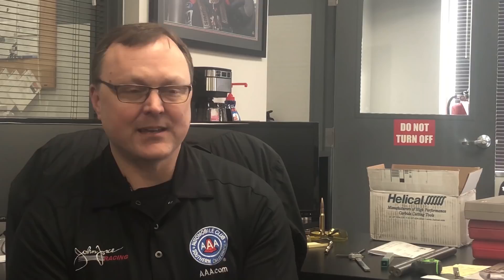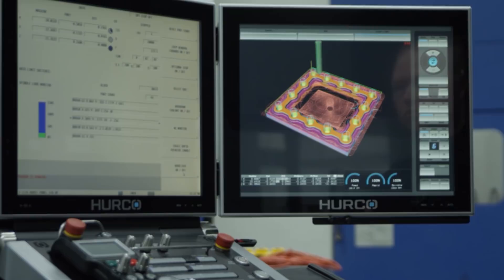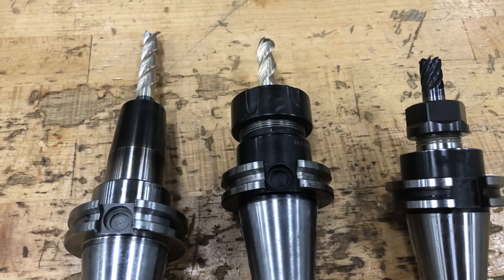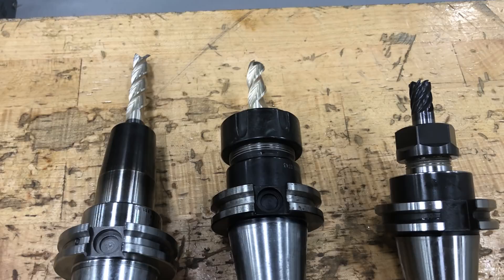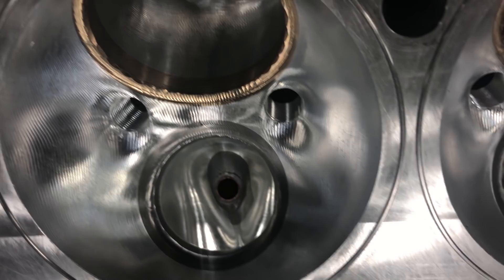The first time I used the Machining Advisor Pro, we were experimenting. I thought we were going as fast as we could with this end mill and we were still having some issues with wear. Dolan came in and explained that the Machining Advisor Pro system was pretty good. So I tried — I went through the system, calculated it out, fed it the materials, and the numbers it spit out I couldn't believe. I just couldn't understand that that would work. So we plugged it into the machine, I hit start and walked away, because I figured the only thing that's going to happen is it'll break the end mill. When the cycle finished, the end mill was still there, the chips were off the part, and the part was still cool — all three of those things were surprises. That's where we started to gain trust in that system.